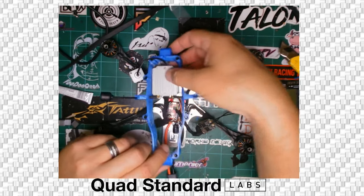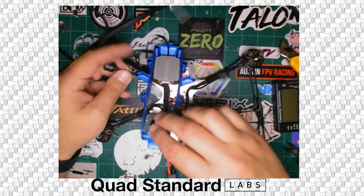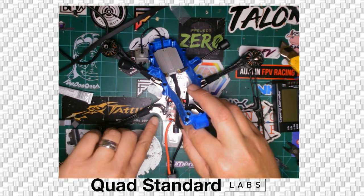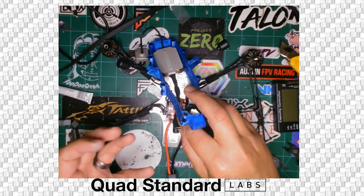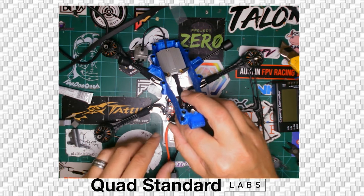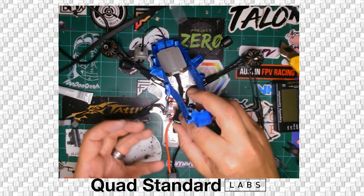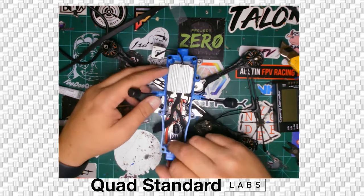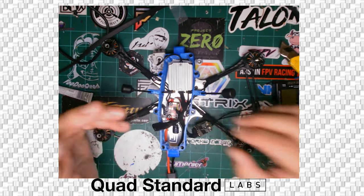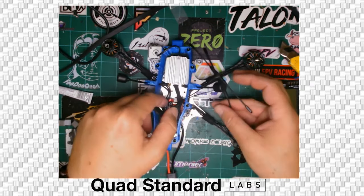You'll get the top and the bottom, along with this skirt which will move around. There's also the air unit in there. The gray paste-looking stuff is a thermal grease — it takes all the heat and dissipates it through that paste into whatever it's in contact with, in this case the aluminum plate. It helps take heat out of the ESCs and transfers it to the bottom.